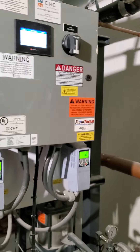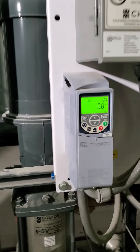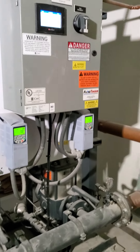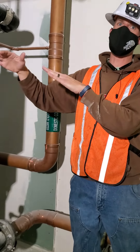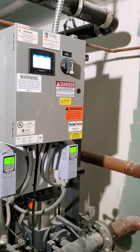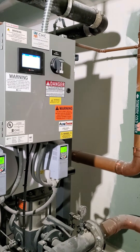Like within 10 to 20 seconds, somebody opens a faucet and then closes it. The pump sees that the pressure is not dropping. As long as the pressure is not dropping below the set point, it starts a timer for 30 seconds. If it sees that the pressure still hasn't dropped, it starts an additional 30-second timer. So after 60 seconds has elapsed, you get a no-flow shutdown. That's to keep the pump from running unnecessarily.